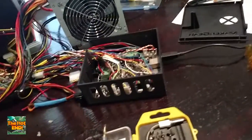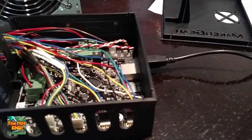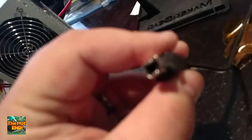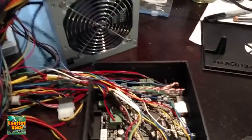I've been very impressed. For the money that I've spent, this is probably the least amount of issue I've had out of 3D printer components. It's just sad — you pay thirteen hundred dollars for an item and due to the flawed design of the board they have issues working. Printerbot when they made their boards put a micro USB connector on the board, which is severely flawed. Micro USB is quite insufficient for most applications outside of prototyping electronics. The Smoothie uses USB-B, which is the kind of connector you want — it's shielded and can stand a lot more stress moving in and out on a board.